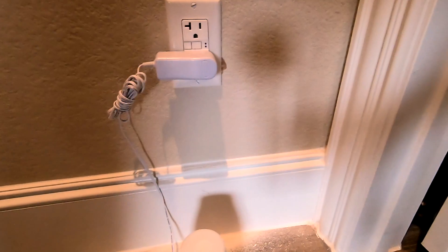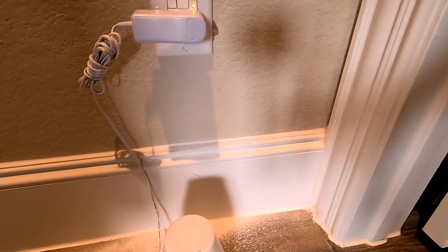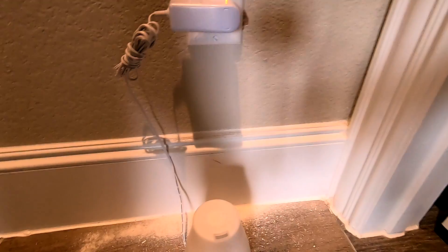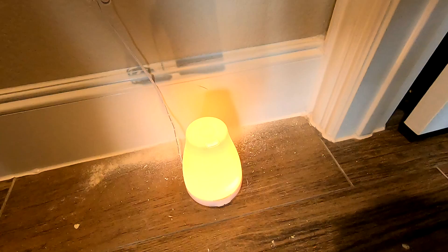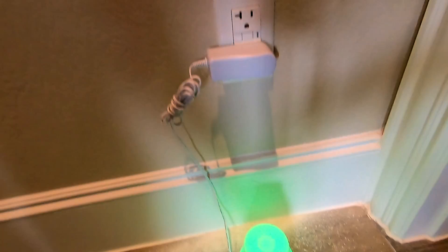Here's our new plug. We just turned the electricity back on at the breaker and we can now do a test. There's a test button here to manually trigger the GFCI fault, and a reset button in the middle. We have electricity — I'm using a light or lamp to show you guys that we have electricity here.